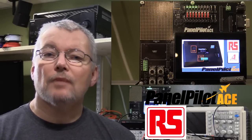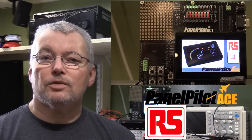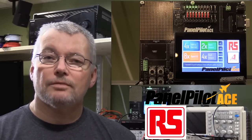This will be attractive to anybody in a variety of fields including commercial or industrial automation, home automation for temperature and humidity monitoring, and industrial settings where you're monitoring the flow of air, liquid, or other processes and want to display status in formats ranging from traditional analog meters to digital displays. The alarm functionality also allows you to trigger a buzzer, flash a light, or use the built-in logic to take other actions — for instance lowering the value of a PWM output — when an analog input exceeds a certain threshold.